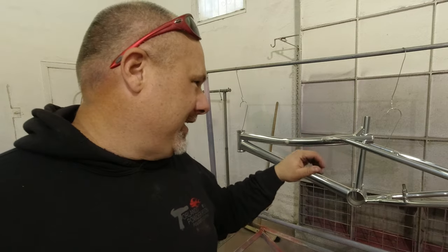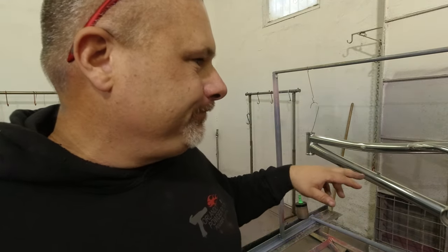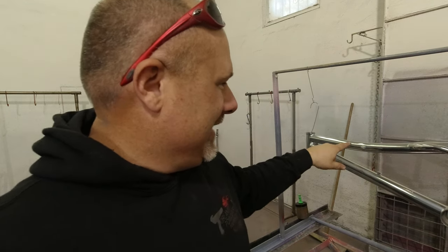We outgassed the frame beforehand, made the repair, but never cured the repair. Luckily I caught it before we fully cured the chrome, because another coat of chrome would never stick on top of a fully cured layer. Because it was only partially cured, cross adhesion between the two coats will still be okay. We'll let it get back to room temperature, sand it out, put another coat up, and fully cure. But we might have a problem — if that isn't all of the moisture, it's just going to happen again.